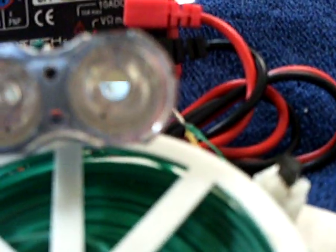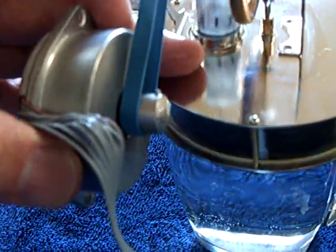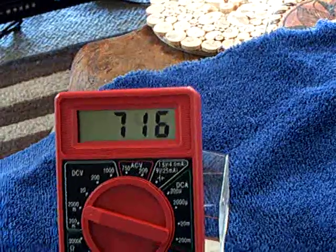It's running this little oscillator here, and you're hearing it out of the radio. It looks like the motor is driving the engine, but it's the other way around. The engine is actually taking the heat energy, converting it to mechanical energy, and that's rotating this little stepper motor very slowly. I'm coming out of it with one diode rectification into this little oscillator, and that's the voltage at the oscillator.